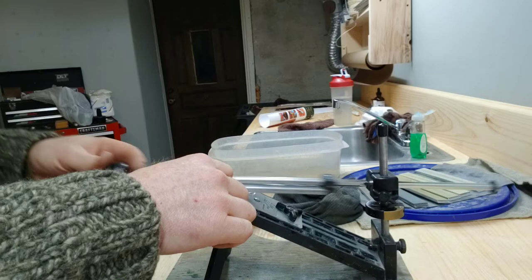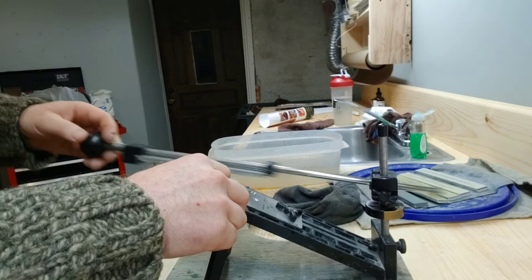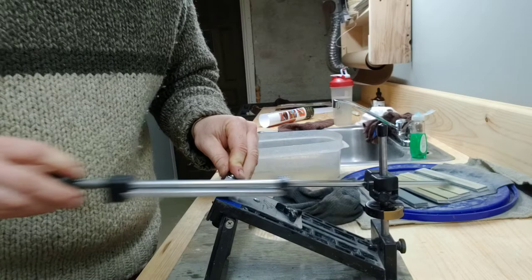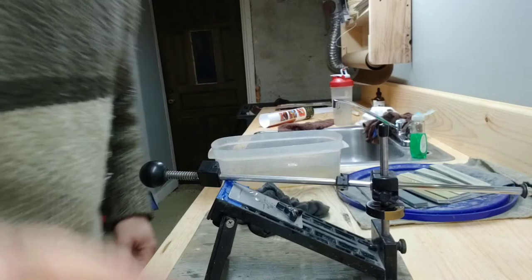Now the finish. I cut that burr, but I'd love to finish with a trailing stroke on each side. This is 4000. Dipping into opinion here a little bit — I kind of think that your cutting quality, once you go up to 1000, you've kind of topped out. If you really want what I call the Facebook finish, if I were doing a high-quality knife I would take it to 6000 — it shines, it puts a mirror finish, it's beautiful. But for cutting quality, it doesn't matter a whole lot. 1000's probably good.